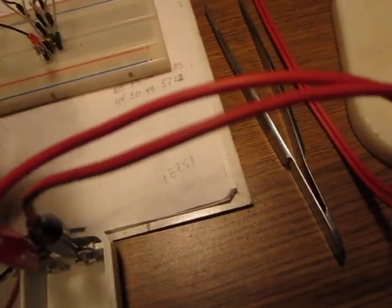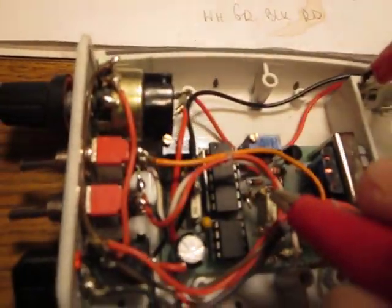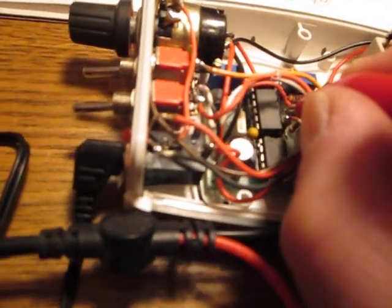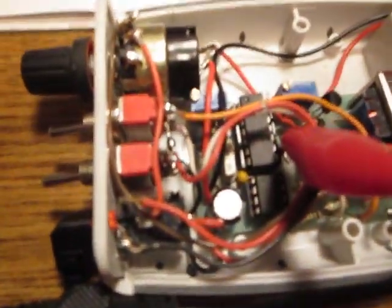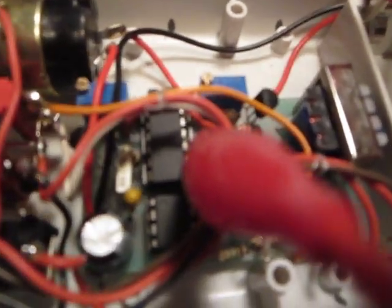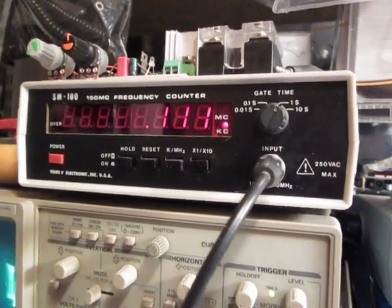Now what I'm looking for, I'm looking for these probes. I'm trying to see behind the camera. I need a ground. Now to swap hands. Now there are two resistors coming from the outputs of the 556. So when I clip on this one and turn the power on, of course, I should read 111 Hertz. That's the output, that's pin number 9 on the 556, and yeah, that's what we get, 111.